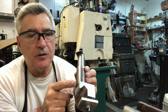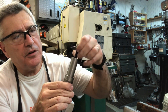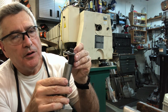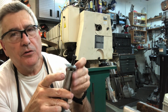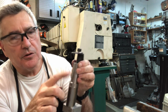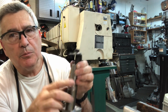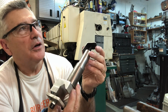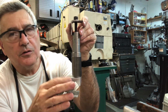The stand basically is fastened to the block here, and then drilled and tapped 3/8-16 again here for a locking bolt, and then a piece of angle iron here that will clamp onto the top of the jaw. And the height of this, I measured it. I'll show it in the video. I just measured it with a scale, a ruler, but I actually measured it with my calipers also, so I could be pretty precise. So I cut that, drilled and tapped both ends of it, and that's all there is to it. So it was a fun project. Took a few days of spare hobby time to complete. And if you'll stay with me for the next 20 minutes or so, you'll see how I machined this thing.